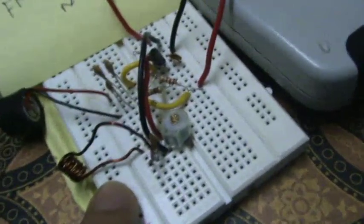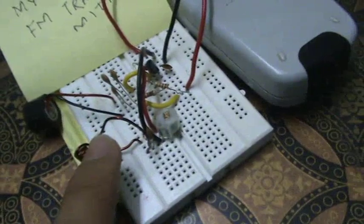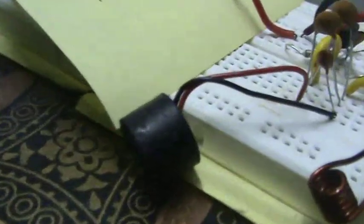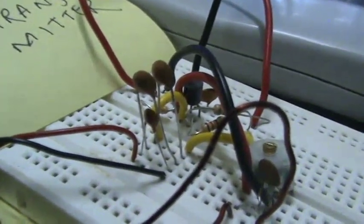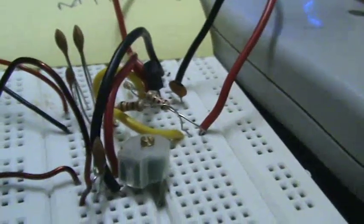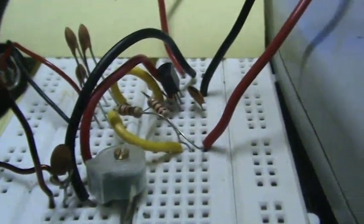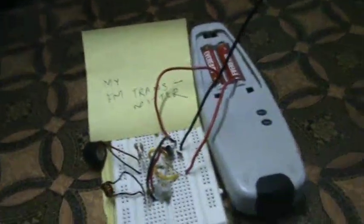Some also suggest that you have to strictly use the inductor coil without having an extra wire, but at the beginning it is all just fine. This is the microphone — I grabbed it from an old telephone. These capacitors are standing and there may be some RF loss, but this is a beginning circuit so we don't want to make things complicated. There is room for improvement — we can make this on a PCB. And this is the antenna, a 10 inch long antenna, and the range of this FM transmitter is around 30 meters inside a building.